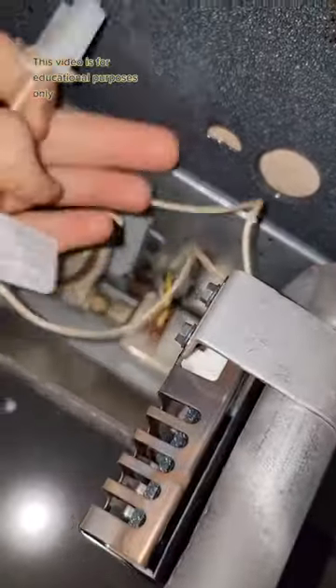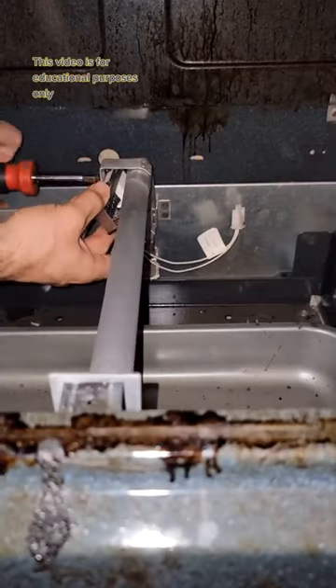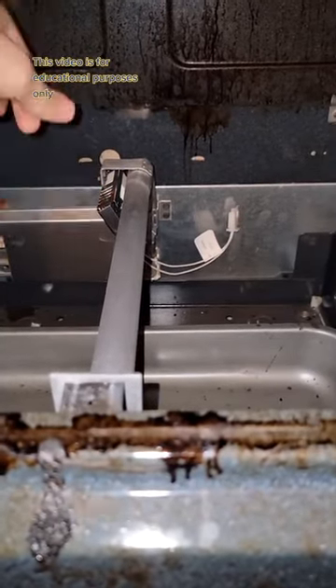There are going to be two wires here, connected with a plug or sometimes with wire nuts. You can unscrew it from the burner assembly and get your new one, then screw it back in place. This one is a generic one — they're only about 20 bucks — but you could look up the manufacturer's model number and get the specific one if you like.